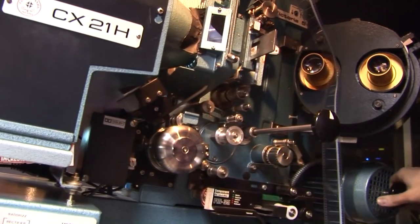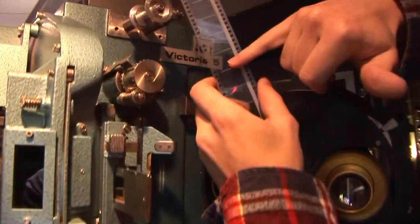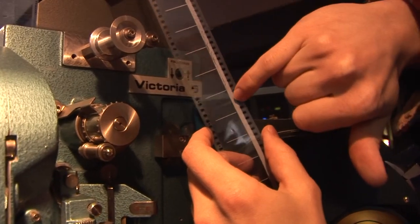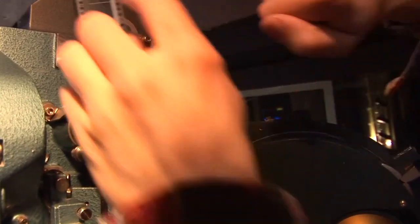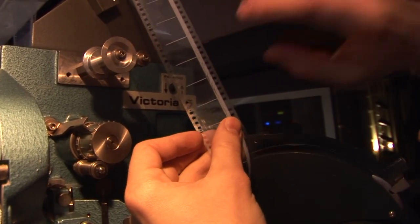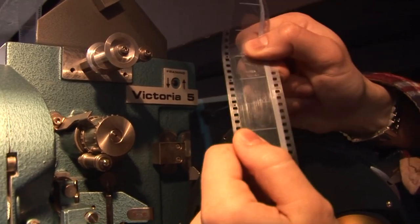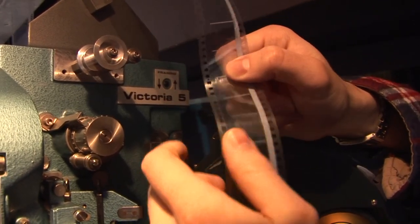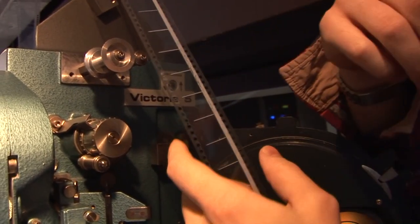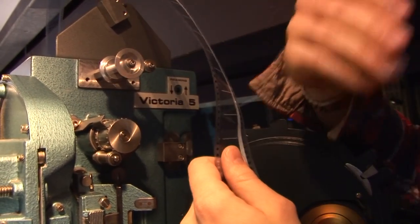And what were you saying about the film? There's three different soundtracks on the film. So, this is scrap film, but at the moment you would have the analogue soundtrack running along here, you'd have SDDS soundtracks running on the outside, and a DTS timecode as well. So you've got an awful lot of technologies rammed in. With the DTS timecode, you have a separate disc? You'd have a system in the rack, you get sent a disc with the 35mm print that you load in, and that has the soundtrack.